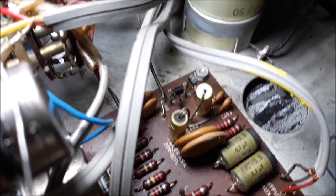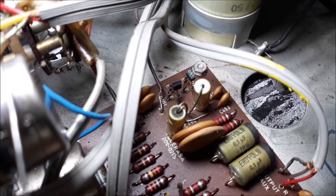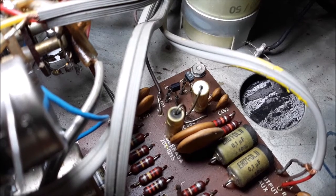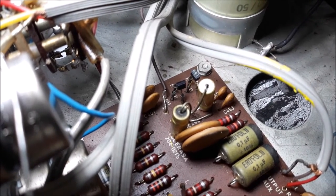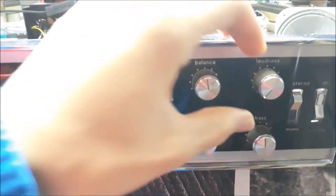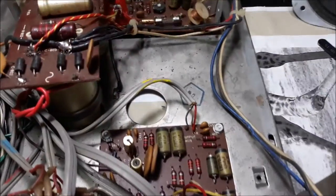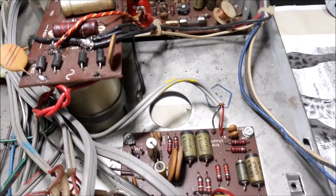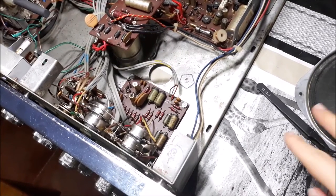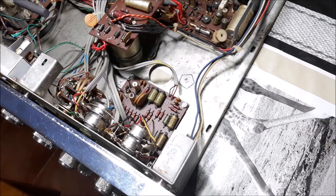The last problem was one of those little transistors — one of them was noisy and I had to replace it. I'm replacing both just to be safe, but that one was the problematic one. It still checks okay electrically, but it's noisy. I put the back transistor in and I'll let you hear — right now I'm in phono, and you can hear all the noise and static.